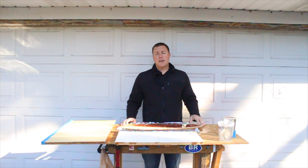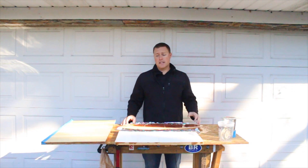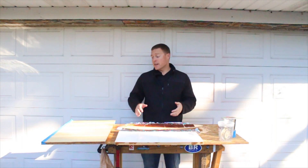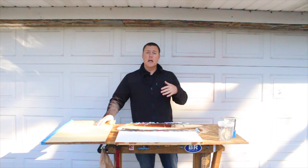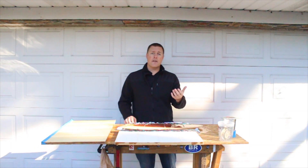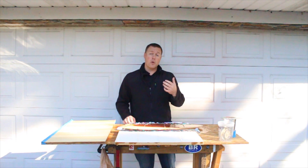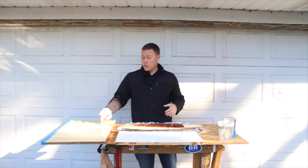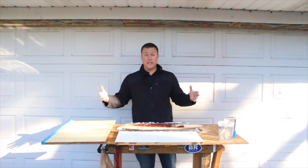I just wanted to throw that out there and give you the information, because we were getting ready to test all these epoxies. We had it sectioned off, it worked out perfectly. I noticed the problems coming up on the surface of this wood, so I thought it would fit really well in a video to help you guys at home. Make sure you have your surface properly sealed before you pour. And like we always recommend, test a very small area first so you'd see something like this before you go pour an entire project.